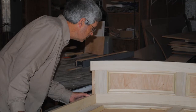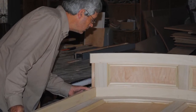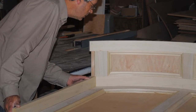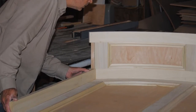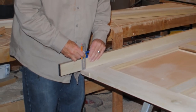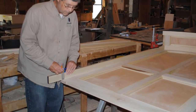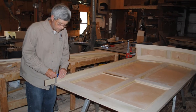With the back panel and top curved panel complete, all I need to do is build the two side jams. I used a short test piece of wood to check what angle I'd need to cut my stiles to get a good joint where the straight sides met the curved top. Once I had the right angle at the top, I used a clamp to hold an extra long stile piece in place, then used a square to mark the cut line that would give me exactly the length I wanted for the side frame.